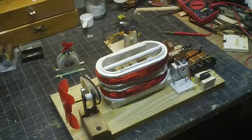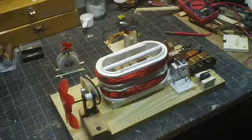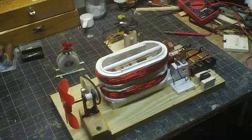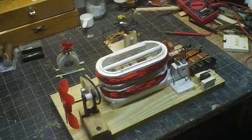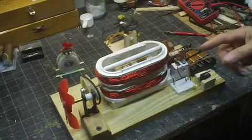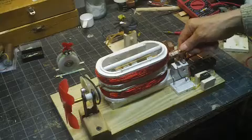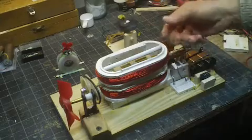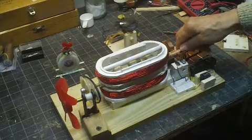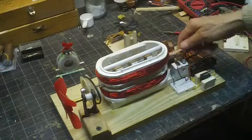The other thing I learned was the simple commutator didn't work. This motor really needs AC to run properly, and that's what this commutator is doing — it's changing this DC into AC. With the simple one, I could use pulse DC as long as I pulsed it just once per rotation. If I tried to pulse it twice per rotation, when I hand-cycled it, I could see that the first pulse was getting a pull and then the second pulse was kicking back. So I ended up putting a commutator like I had on the previous Newman motor that converts this DC into AC.